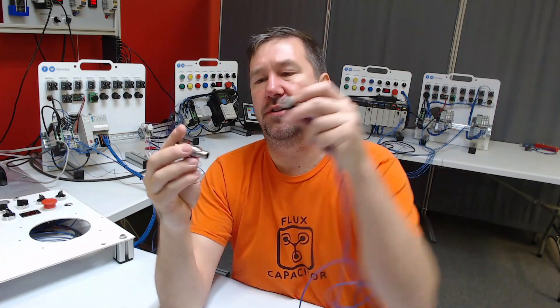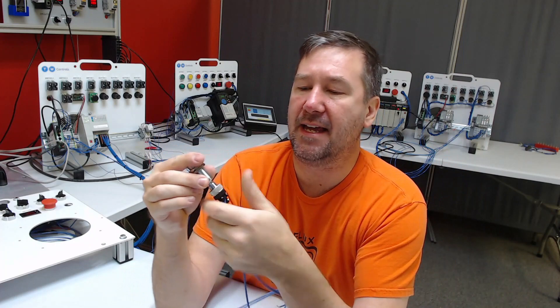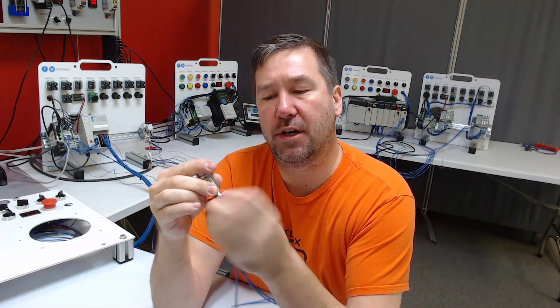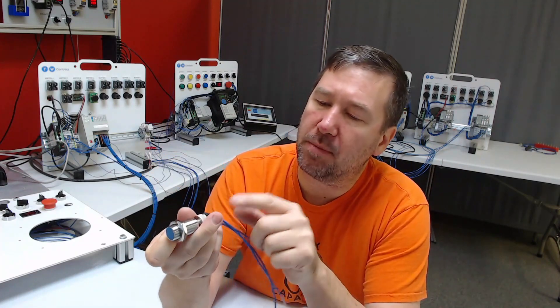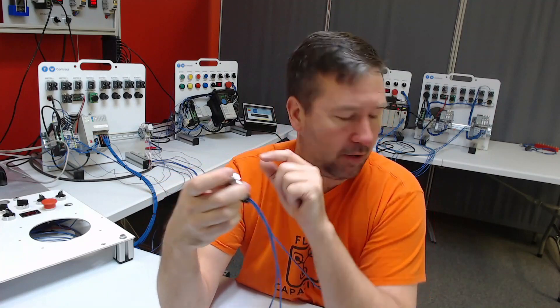What I'm going to do is take a cable and connect it to my sensor. In this case, terminals 1, 2, and 3 are the ones we need. One is going to be our plus voltage, two is going to be our analog signal, and three is going to be our minus.